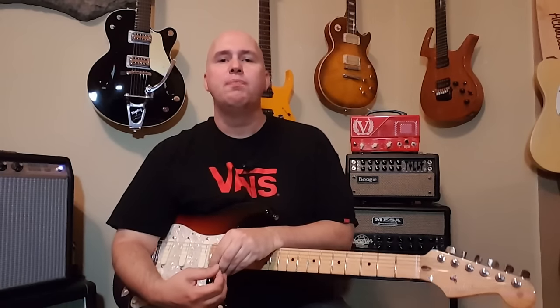In an amplifier, you can't get as loud — but you also can't burn it up, which is what we're going after here. We're not trying to destroy our amplifiers. So the rule is: if it says it wants 4 sumo wrestlers, you can do 4, 8, or 16 sumo wrestlers. If it says 8, you can do 8 or 16. And if it says 16, it needs an army — it needs 16 sumo wrestlers, so you can't run it into 4 because it's not enough resistance and the amplifier will burn up.